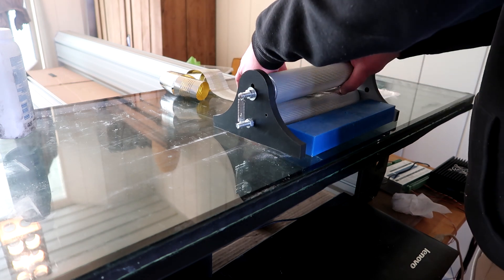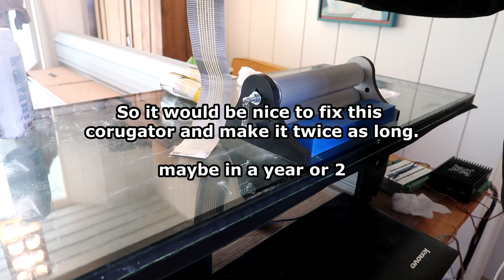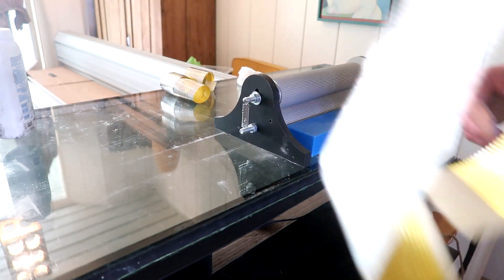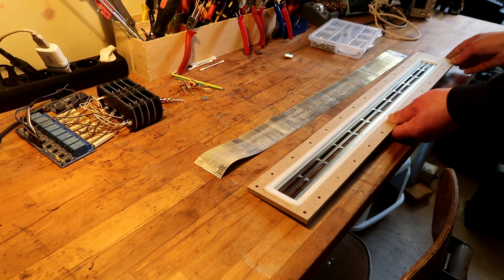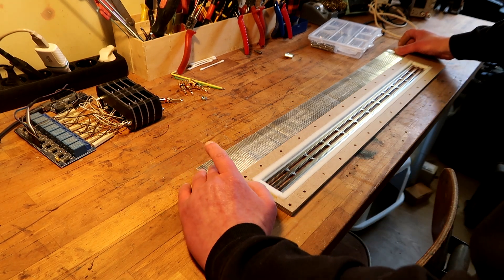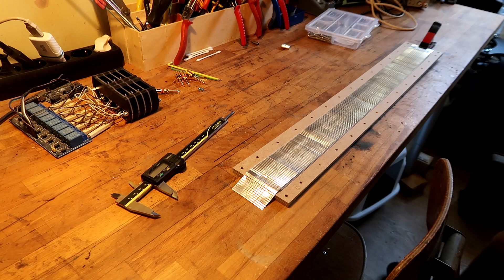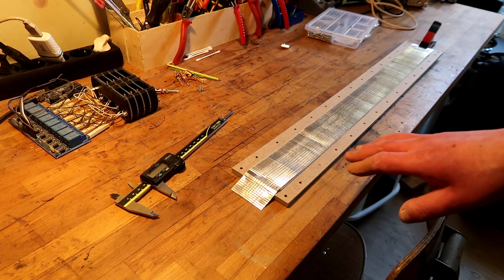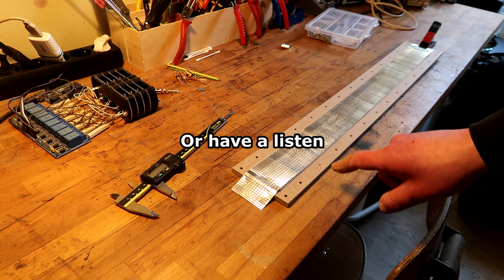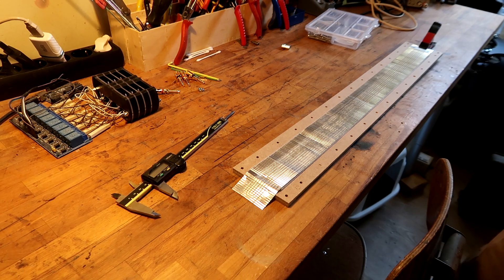It's nicer if you do it in one go without it drifting off. Now I've got stages you can clearly see — they will be gone if you pull on it, but still, it's not ideal. They look to be a bit long. Too long — 2.4 centimeters too long. I'm going to finish these two coils, put them in one of the frames and do a measurement. If I think the Kapton is not working, then I have to redo it anyway and I can adjust the size as well.